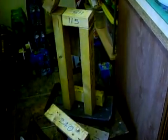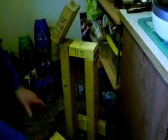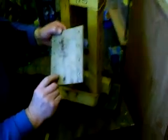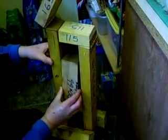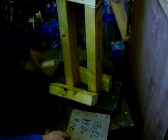The lengths are marked on it and I'll put them in the annotation in the film. For the front and back I've used 8mm thick plywood. I have drilled a number of 3mm diameter holes in it, but I've found that not much water comes out of these because the piston has got plenty of clearance and the water tends to come down each side of the piston. So I don't know how beneficial these holes are — you can leave them in or take them out.